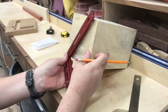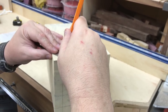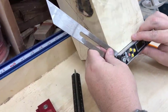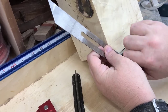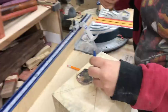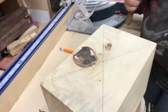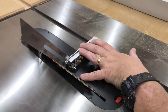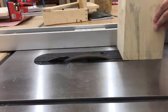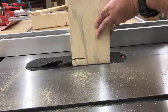When that's done I'll take some careful measurements and lay out all of the angles. If you want the free plans, they'll be in the description so you can see what those angles are. I'm going to use my bevel gauge to hold against my saw blade to set it exactly. While the block is square it's a good time to draw diagonals and put a little hole punch in so I know exactly where I'll be drilling for the handle. I know from my measurements it's supposed to be 120 degrees, which is actually 30 degrees down from 90. I'll make sure it looks right on my board and then go ahead and make the cuts.